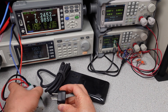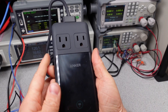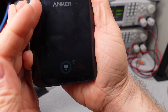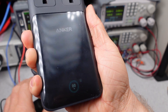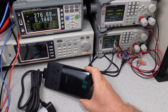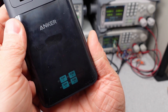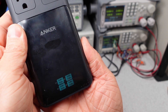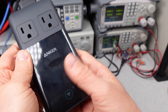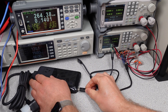The first thing I see with this power adapter is that it takes high idle power consumption, meaning it does not meet the DOE requirements right off the bat. The adapter isn't far over the line, but it is over — although it didn't make the claim of meeting it at least. Now that it is on, time to look at that shiny display. It is very similarly stylized to what the power banks Anker is selling now. The button changes mode to different views: total watts, watts on each port, volts and amps on each port. It also looks like the display tells you if you have an eMark cable plugged in. You can also press and hold the button to get the little Anker animation.